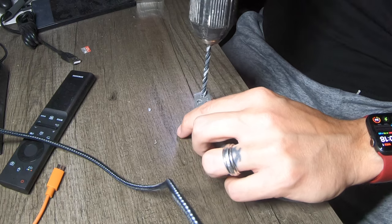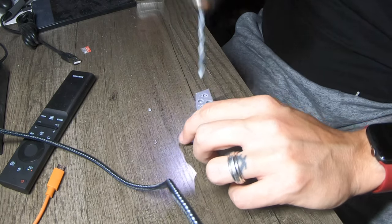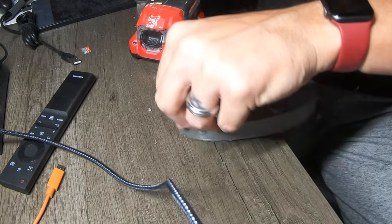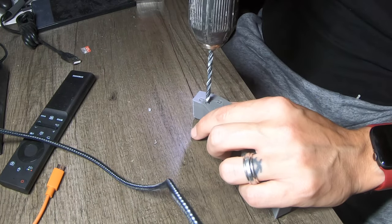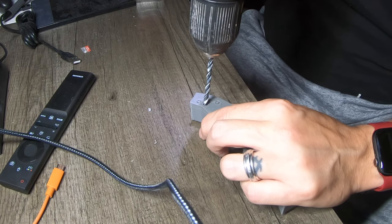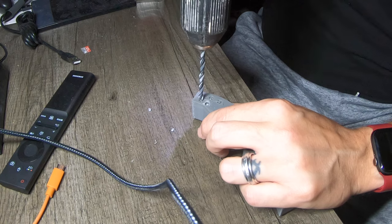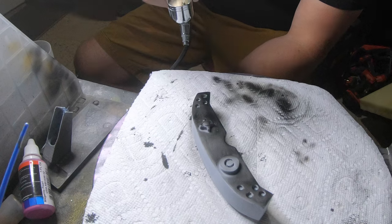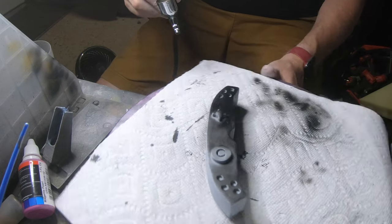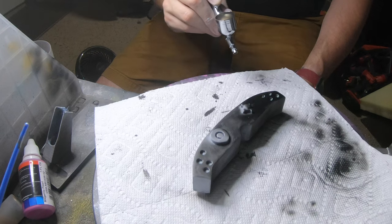As you can see, those little holes I made with the little dots in the middle just didn't come out very well. Everything else printed out fairly well, but those — I think it's just because of my printer speed. I've got it set a little bit too fast for something that's small, normally because I'm printing things that are so big that I don't really care about the detail on it. I did go ahead and throw on a couple coats of filler primer, as I usually do, and then sand it a little bit.